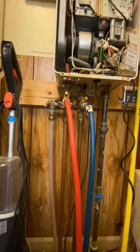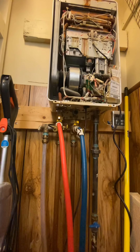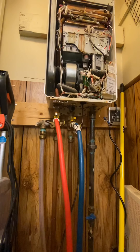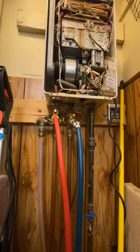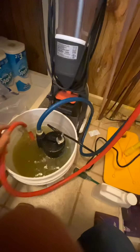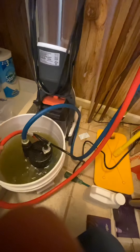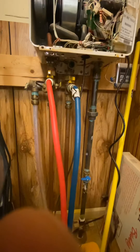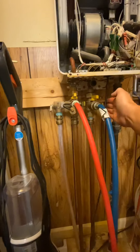We're descaling. Hope this video helps somebody. If you have any questions, put them in the comments and I'll try to answer them. Be sure to like and subscribe to the channel. If you have to do a water heater descale, this is all there is to it. Put a couple gallons of water in your bucket with some vinegar or a cleaning solution. Hook your cold hose up to your cold side, hot hose up to your hot side. Open your two service ports, get your water off coming in, turn on the pump, and let it run. It soaks it out of the bucket, puts it through the machine, and then back into the bucket.